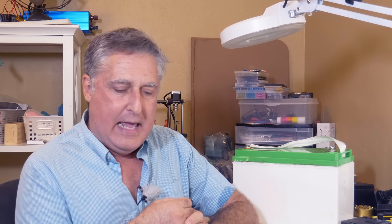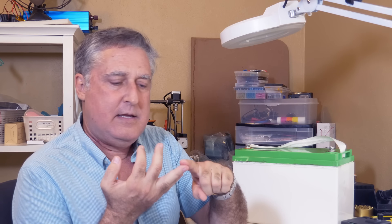To do this right — and I'll give you a hint of how my device does it — I was a professional engineer for most of my life, and this was one of the harder problems I've ever had to solve. I needed to watch the voltage, watch the current, remember the history of what the battery has been through, take timings on certain phases, and put them all together with multi-dimensional math. Each one of the variables modifies the other variables. I ended up with a mathematical software equation that can look at the electrochemistry and model it — and it can model it very accurately.